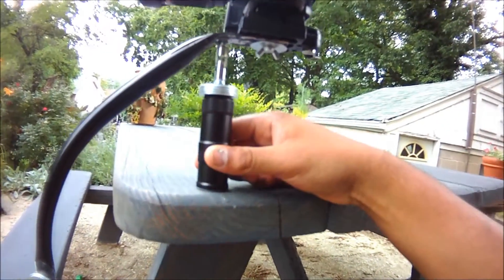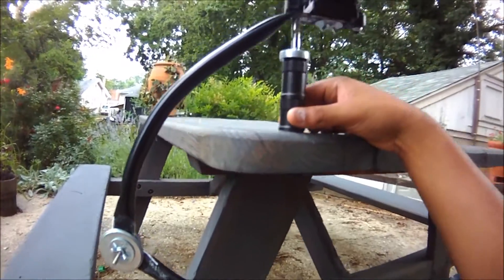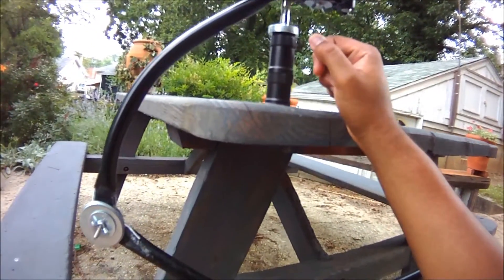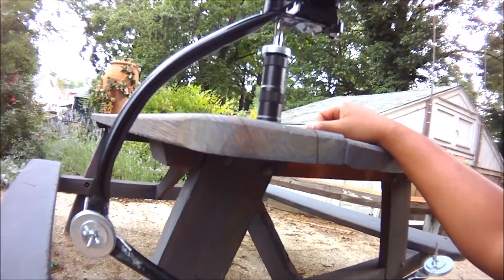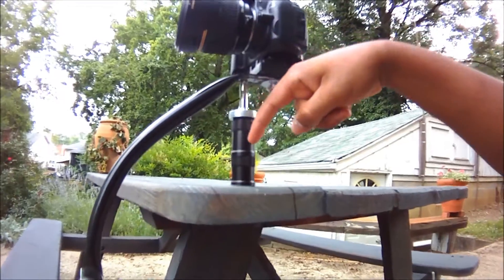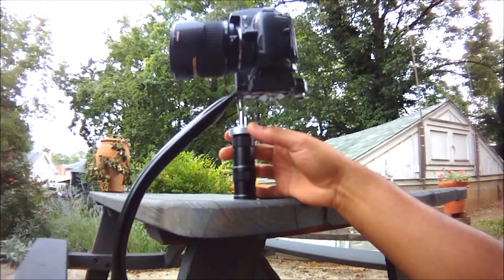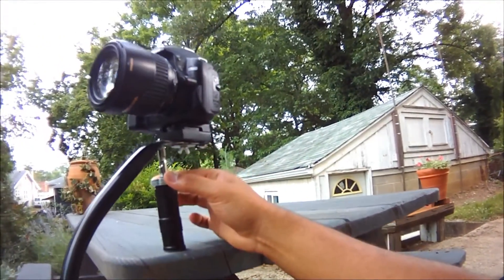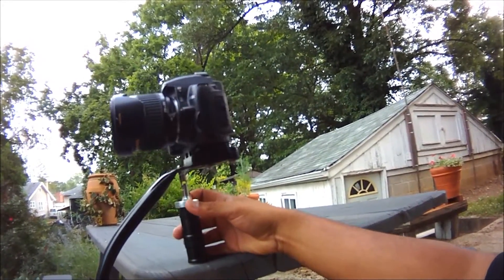For the handle I have an aluminum barrel from an airsoft flashlight that comes in four pieces so you can extend the barrel and add more batteries. I cut the bottom off, which has the male threads, and screwed it into the female threaded side so I could clamp skateboard ball bearings in there. Sitting on top of the ball bearings I have my u-joint with a four millimeter bolt going straight down through the ball bearings, clamped with a lock nut, and a stack of washers as a panning ring. When holding the Steadicam I hold the handle and use my thumb to turn the camera.